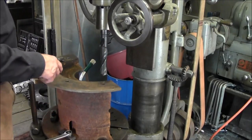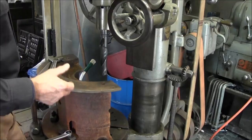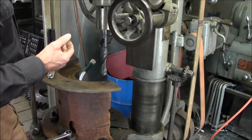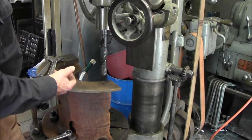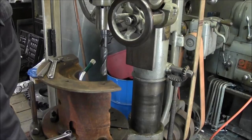All right, we're in our back gear right now, and we're going to touch off of here. If it's a curly chip that comes out of here, you know it's going to be cast steel. And if it's flakes and they crumble, we know it's cast iron. That will kind of determine our welding.